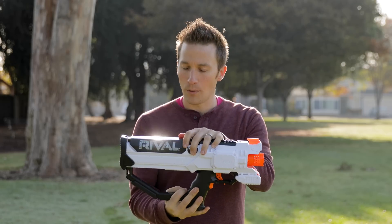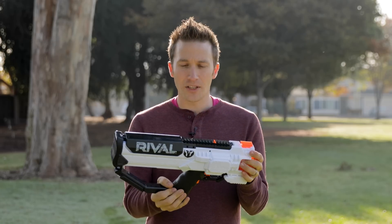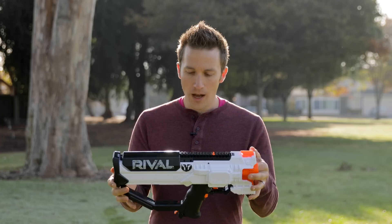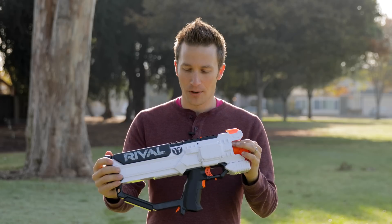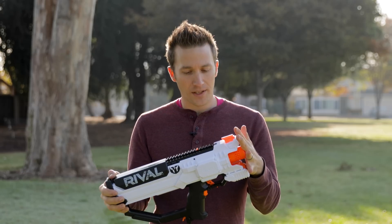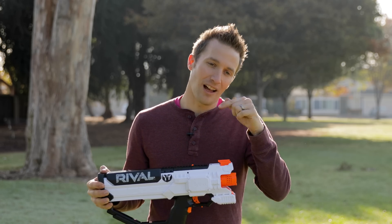This is of course a MOSFET rewire — I do sell these on my shop. I'll have more of them in stock by the end of next week. The MOSFET mod is pretty easy to do; it's just another five or six solder joints from the normal mod, as well as two resistors, a diode, and the MOSFET itself. I will have a full tutorial on the MOSFET for this as well, but in the meantime if you're looking for one, Tom from Foam Data Services has one too — I'll put that in the description.